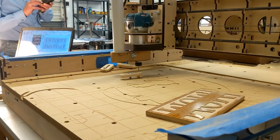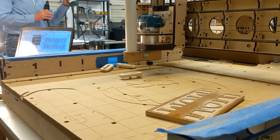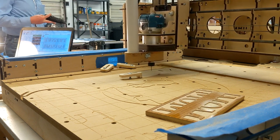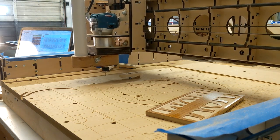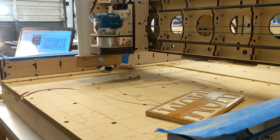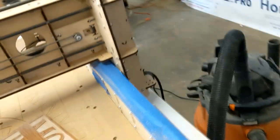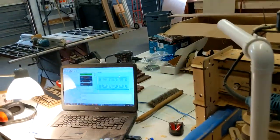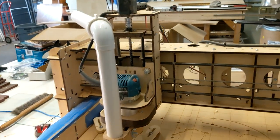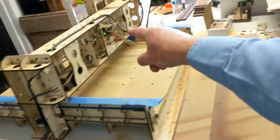I'm going to go over and try the Dremel. There — it just went. So the two ways to stop this: first, be aware that when you're running the CNC not to turn on any power-surging devices like the shop vac or a Dremel — it happened with the Dremel while I was working. And second, figure out how to get a spike protector into the system, connected to the controller on your CNC router.